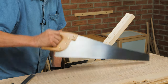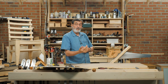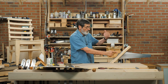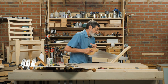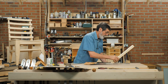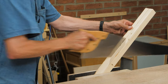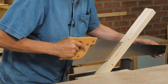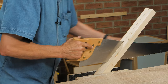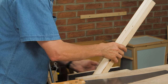So we're back on track. Turn the saw around, work from both faces like this. The other thing is you've got to get this elbow, this shoulder, and this hand in alignment with that piece of wood, and you also have to get your eye in sight too. So we're aligning our whole body according to what we have here, and suddenly we're straight again. Don't forget — you use the tip of the saw to push this side and just work it this way until you're back on track. That's how you saw straight using a handsaw in a rip cut pattern.